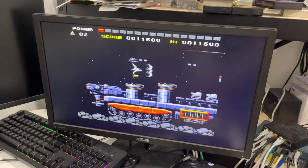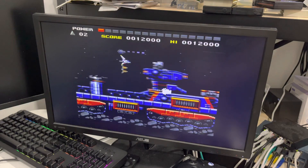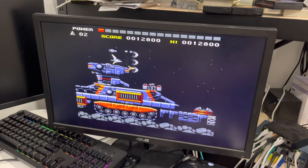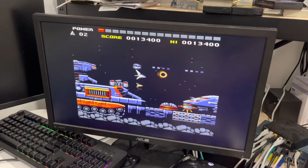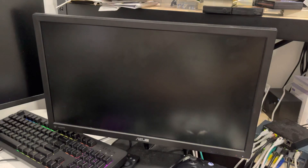Since there is a difference in lines produced by the VDP and the HDMI output, I had to fix the clock. It's using 525p for NTSC and 625p for PAL. You can see this game running — I'll show another game next.